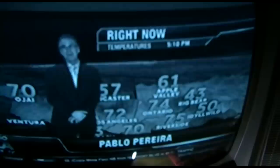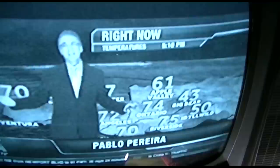It's obvious this needs some capacitors. You probably can't hear it in the audio, but there is a very low 60 hertz buzz in it. This TV was always a buzzomatic discriminator. No matter how I aligned it or adjusted it, it was always that sizzling, could not deal with the high contrast, modern.